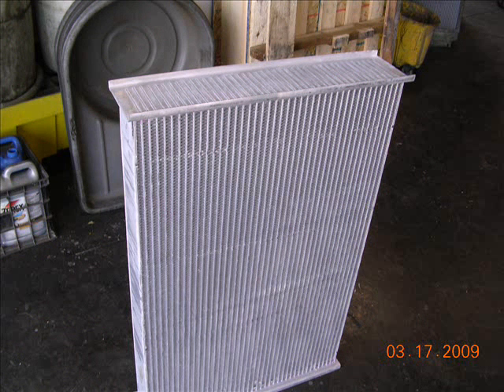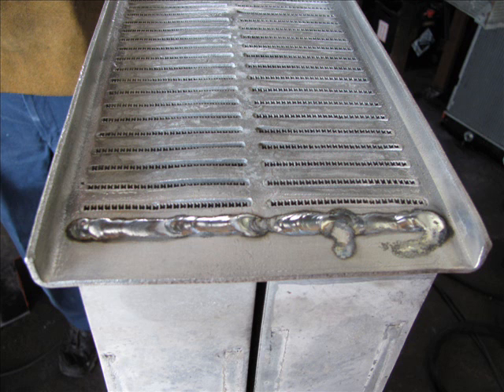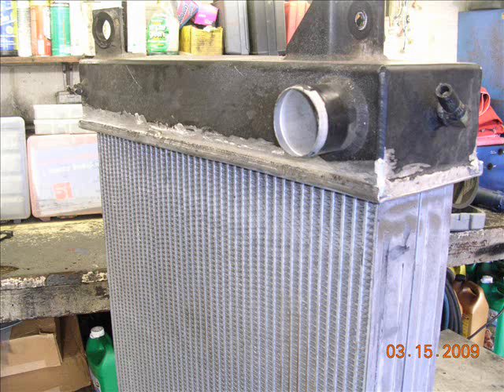There's the core on the floor. Only a couple of places in the United States make these. We kill the end tubes on them before we put the tanks in — it's just a general thing that we do so that it decreases any chances of vibration causing the tubes to leak.